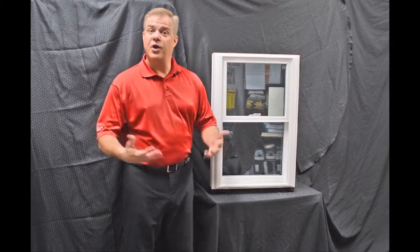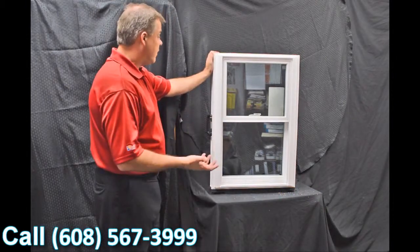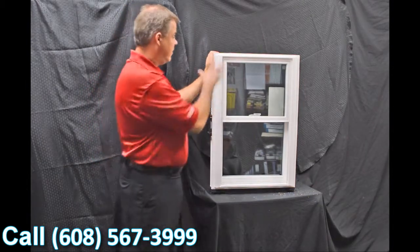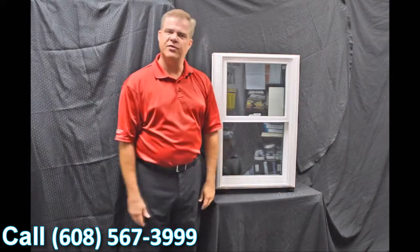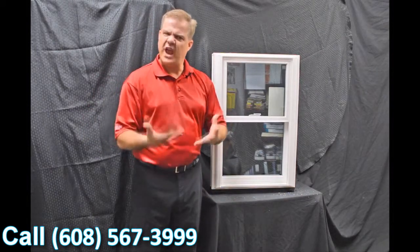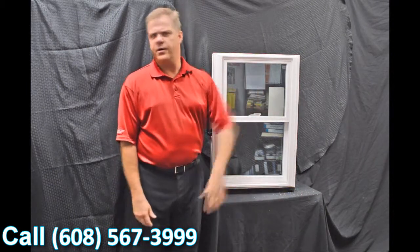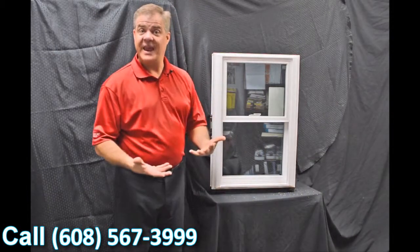Hi, I'm Tyson Schwartz, Vice President of Sales and Marketing for Soft Light Windows. Today I wanted to talk about Zen Windows and the Karma window. Moving to the exterior of the window, the first characteristic is that this is fully fusion welded — the sash and the mainframe — versus some inexpensive options that are mechanically fastened. The challenge with those is they loosen up over time and air and water can get inside them. With a fully fusion welded window like this, it just can't happen.